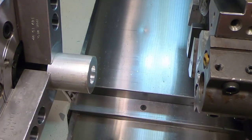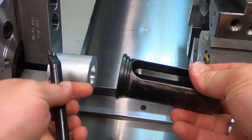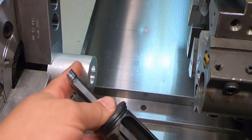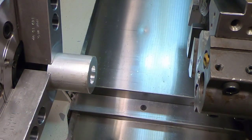The first thing I'll need to do is find a sleeve that will fit my boring bar. Once I do that, I can go ahead and start the process. This is actually a pretty quick process once you've already drilled with your insert drill, because you're already pretty close to where you need to be.